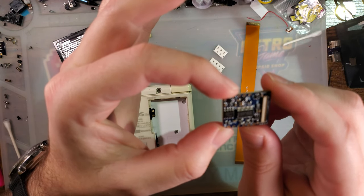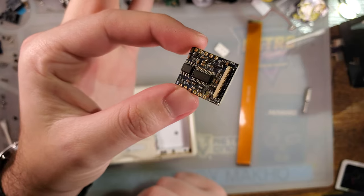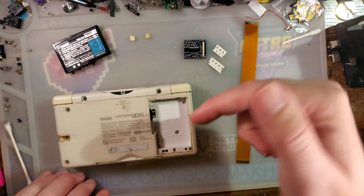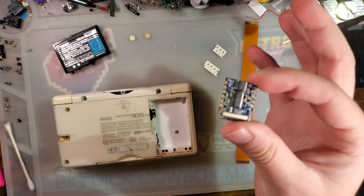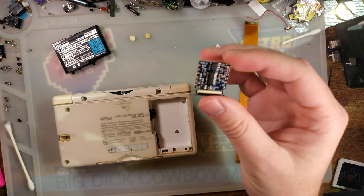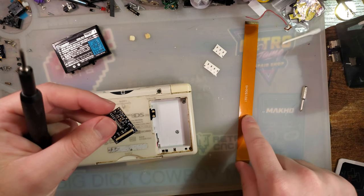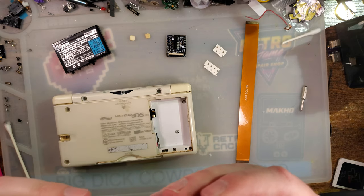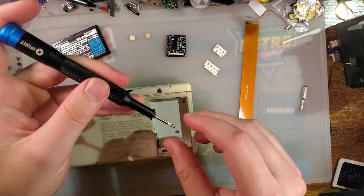I believe you also need to do a little bit of messing with the audio. I'm not 100% sure exactly what this is doing, but if you check out the GitHub from Preserving NDS History or NDS TV, I'll link it in the description, but that GitHub documents exactly how this board works. This is the exact same as the other board, except that it has a couple of extra features built in. But as far as taking the TV out signal, which is what we'll use this cable for, this works the same way. The extra features are that we don't have to have dedicated buttons. We can actually use button combos on the DS Lite.